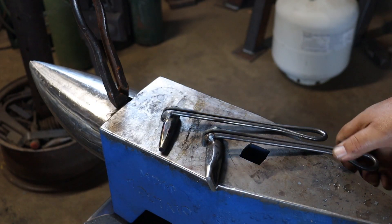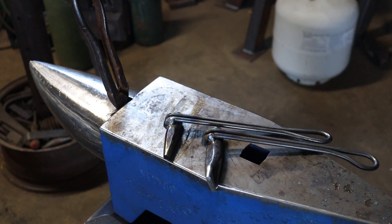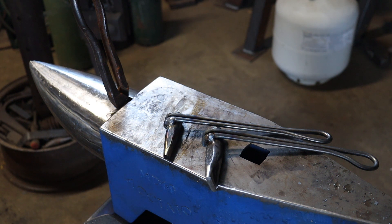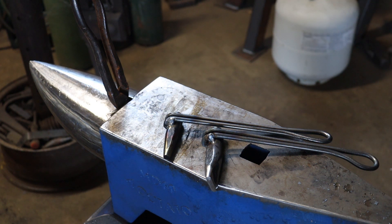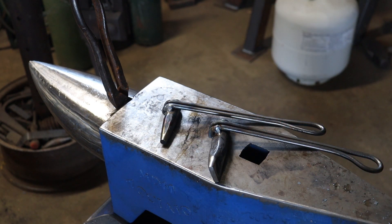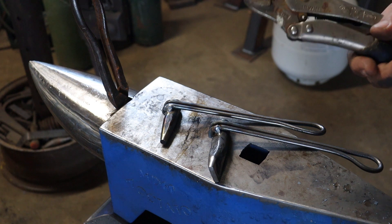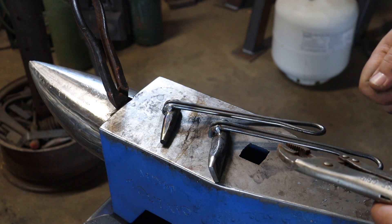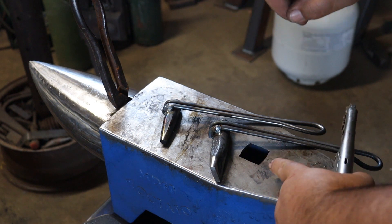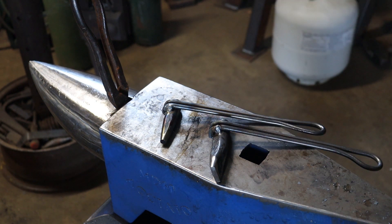Here's our slot punch and our round punch, specifically for making bottle openers. You can use them for other things, but that's what I made these for. I've got a class this weekend, so next video I will show you how I forged the bottle opener. I make these short because they're a struck tool and I'm not holding them with my hand. If you don't have a welder, don't freak out — you can always just hold them with a pair of vice grips. The shorter they are, the more swing you get before you impact them, so you get a little more oomph.